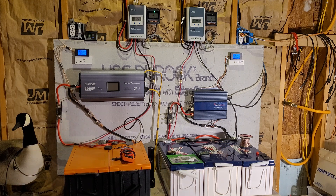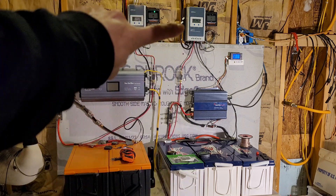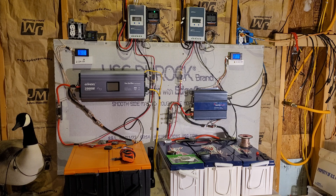With what I have now, I have 410 watts on this system and 280 watts on this system. The extra wattage on this system rarely pushes over 25 amps on a 30-amp charge controller, and it's already over-paneled a little. Over-paneling by another 60 or 70 watts would bring it close to 30 amps. Allowing a 40-amp system to over-panel to 600 watts is practically perfect in my opinion. I wouldn't mind being able to over-panel that much and know I'm not going to destroy or blow out anything — that's why I recommend it.